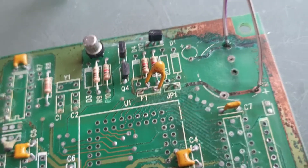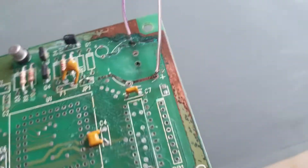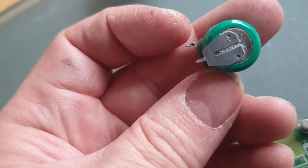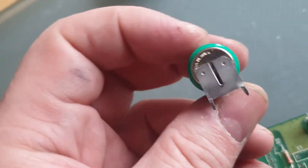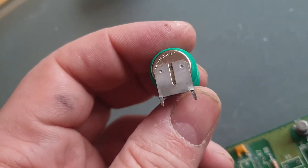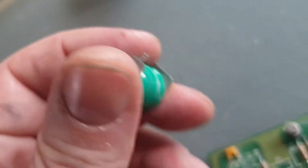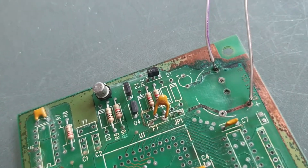We've now got two cables that are really nicely attached. You can use a multimeter, although the state of this board is probably not worth it - this is just for illustration. A really important bit now: if we look at the battery there, we have a nice plus on it. This battery's not in a good way by the way - it's just the one I've grabbed for illustration, you'd bin this. All we want to do now is find a plus and a minus - join the plus to the plus and the minus to the minus. On your fly leads, the minus is the top one and the plus is the bottom one.